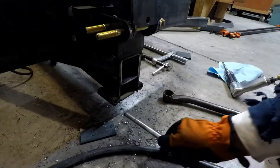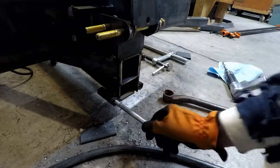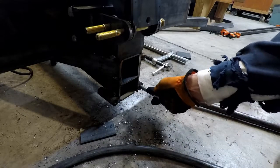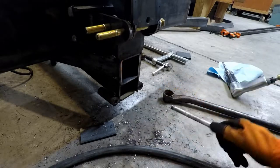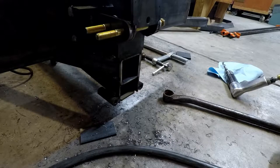These holes were drilled exactly on size. You can see this bolt actually goes in there pretty well. But this other one — I think with some weld distortion — made that really hard to go in, so it's hard to push back out. That would be a problem in operations.